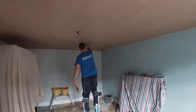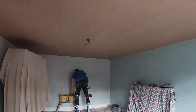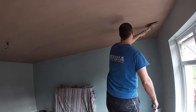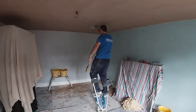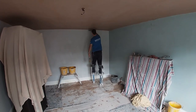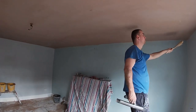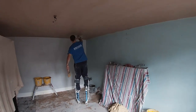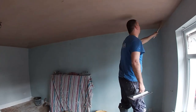A lot of people prefer to use flexi trowels just on ceilings and don't like using them on walls, and again it's all preference. I personally think the flexi trowel on the last coat is perfect. You don't have to run out and get lots of trowels — everything can be achieved with a nice broken-in steel or carbon steel trowel as long as it's broken in right. I could finish this ceiling with the right angle and pressure with a normal stainless steel trowel, but I can tell the difference in how your joints are reacting at the end of the day. Flexi trowels for the third and fourth coat is the way to go.